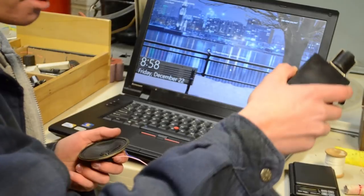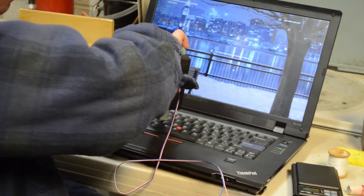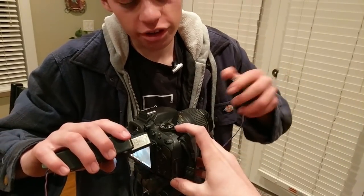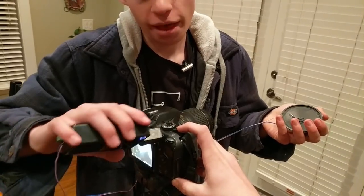As you can see this laptop has a lot of hidden noises — you can even hear the hard drive spinning inside. Here we have the feedback loop to show you: as the speaker gets closer we get a lower and lower frequency on the induced signal. When we put it directly above it we get nothing, because viewed as vectors the component has zero induction in that orientation. At 90 degrees it is perfectly orthogonal so nearly 100% of the signal is induced. That's the interference — and it sounds awesome. That sound every time the camera zoom moves is actually the motor moving, because the motor creates an electromagnetic field that we can hear through the coil.